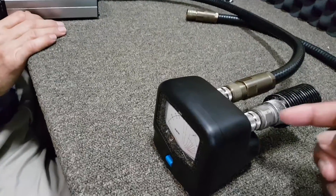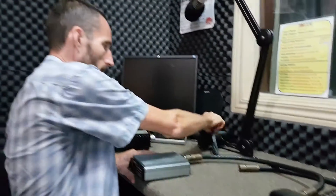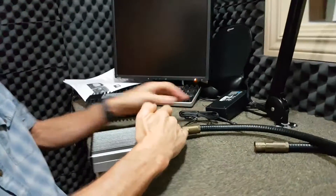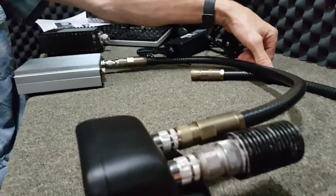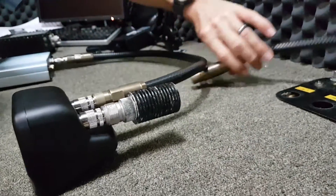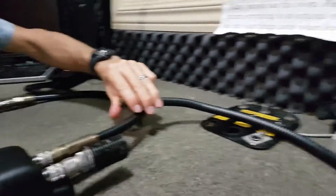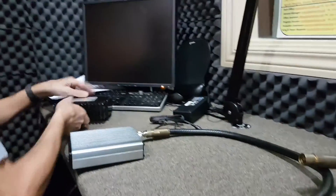The antenna that gets hooked up on the ANT side is coming in from the actual antenna - your coax from your antenna could be hooked there, and you could do testing of your antenna also. Or you can hook up the dummy load on the antenna side, and the dummy load simulates an antenna. Now I've got the transmitter hooked up to the coax and into the watt meter, with the dummy load on the other side. If you had a bigger dummy load, you might need to hook in just a piece of coax and then attach the dummy load on the other end.